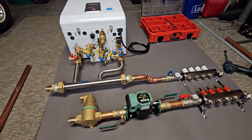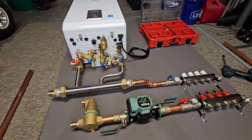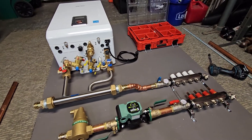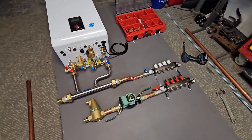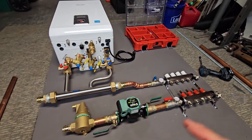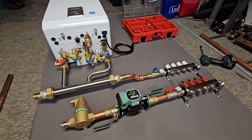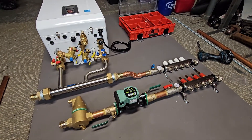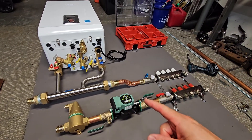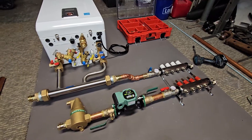One thing I'd like to explain, because I've been asked quite a bit, is the price difference matters a lot more when you have multiple zones. These Navien boilers can do up to three zones internally — and that would be on the combi models. The heat-only models can only do one zone without an external zone controller. So if anyone comes to me and says they don't need domestic hot water but they want two or three zones, I always tell them: if you have a possible need for hot water, the most bang for your buck is getting a combi because it can do up to three zones. Anything above three zones, you'll have to add an external zone controller or switching relay.